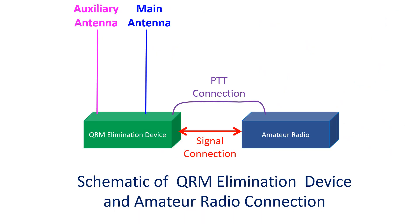The two antennas need not be of the same type and even the feeder cable need not be of the same type. As any amateur radio operator is aware, it is easy to get a 75 ohm television cable from the local market, while a 50 ohm cable needed for amateur radio usually has to be ordered and is more expensive. Hence the option of using a 75 ohm television cable for the auxiliary antenna is quite comfortable, and QRM elimination devices have matching modules to accommodate the 75 ohm cable.